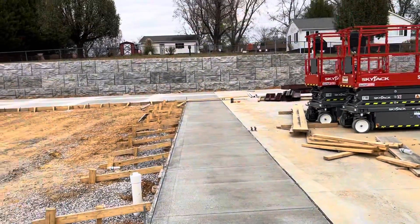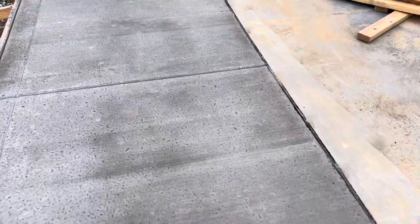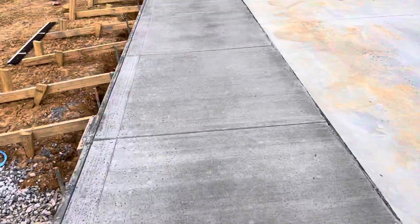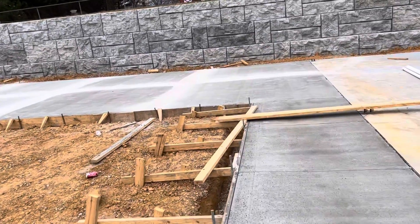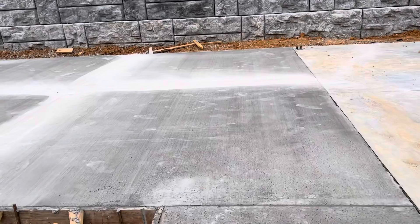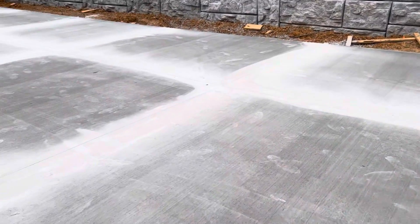You can see everything is poured here. When they put the concrete they did the joint at the same time. You can see the expansion joint every 25 feet, and in this concrete area they also did a saw cut.